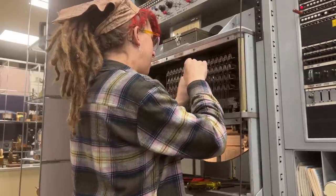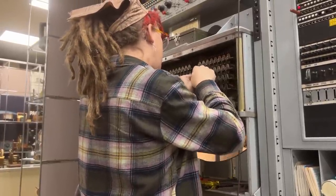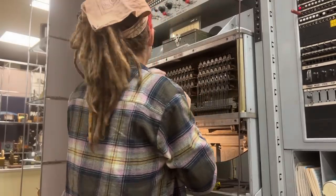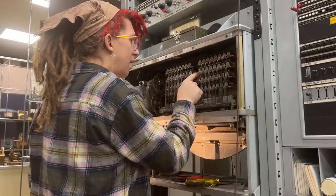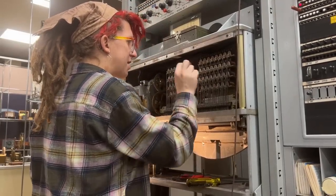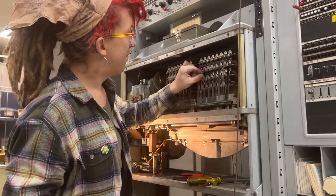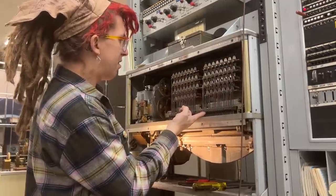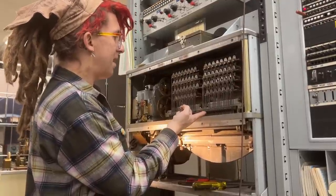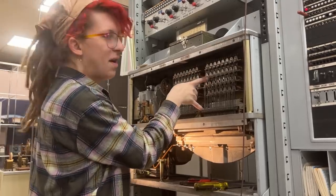After the main parts of the recorder were put back together, it was time to do the phasing and timing routine. I have mentioned before that the recorder has a complex series of phase adjustments that all need to be correct relative to each other. Since the punch mechanism was completely removed, we couldn't trust that the phase of the card transport would be in synchronism with everything else, so we spent an hour or two checking and rechecking against my previous notes.